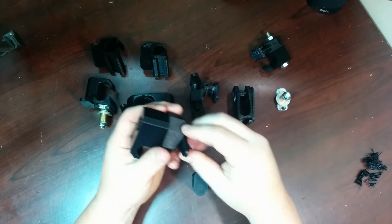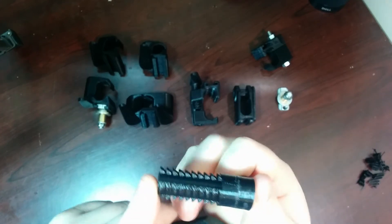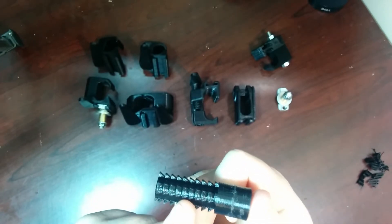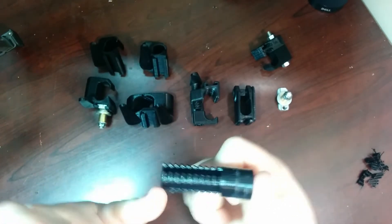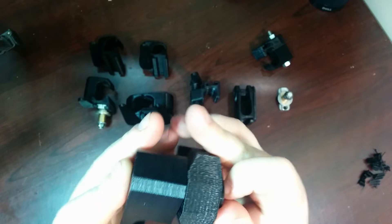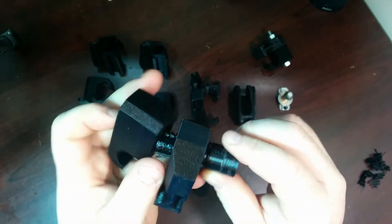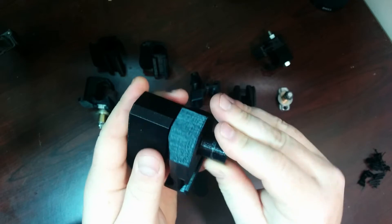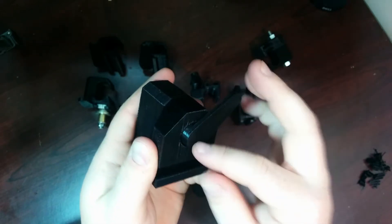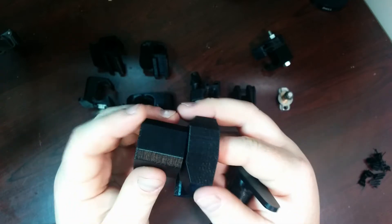From there, I went and did some research. With the research, I came up with this design. This is called a buttress-style thread. You might be able to see on the thread profile that there's a 45-degree and then a 7-degree relief on the top side. That gives it all the strength in compression, but not that much strength in elongation. With this design, it gives the most strength in one direction — basically the clamping force. These threads are typically used for cannons or heavy artillery because they can slide into place and lock in. This gave me a lot of insight, but did not have enough throw to give a nice, tight hold.